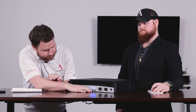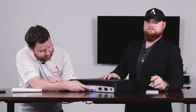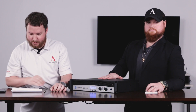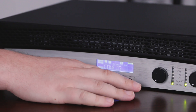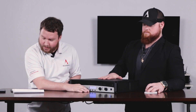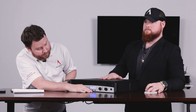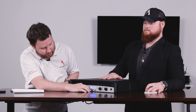All of this revolves around the three buttons on the front. The first is Select or Enter, where you make your selection. Previous or Up is Next, which is how you cycle forward to the next option. And then Next or Down, which is how you change to the next page. So I'll kick it off: I hit Select — now it says 'Preset.' I hit Next to go to a different preset — now it says 'Config.' I hit Select for Config. I'm in channel one, Low Z. If I want 70-volt, I hit Next to change it to High Z. I switch back and forth to make my selection. If I'm good with that, I hit Enter. Now I'm on channel two, and you'll see it's flashing over here showing my 70-volt settings.